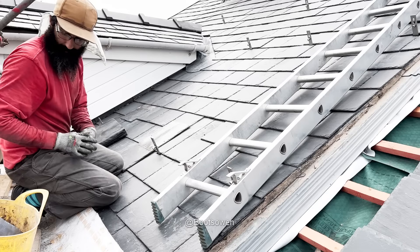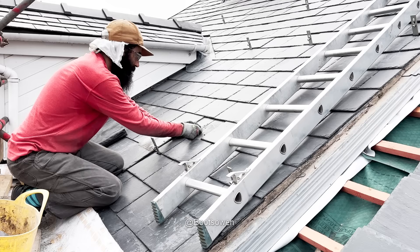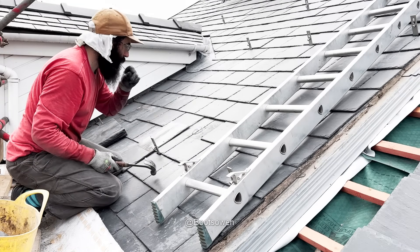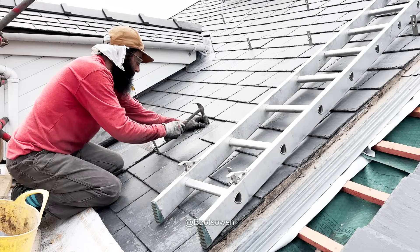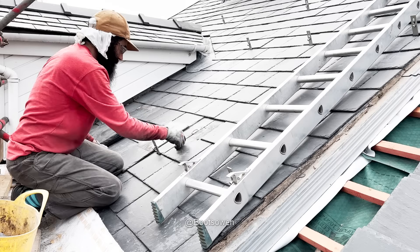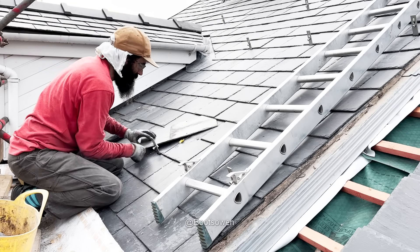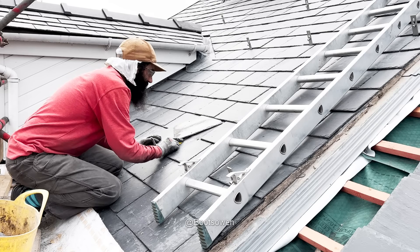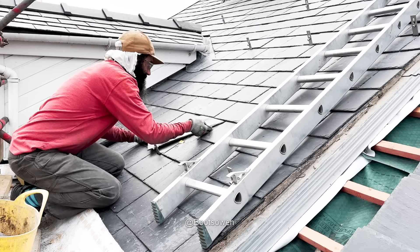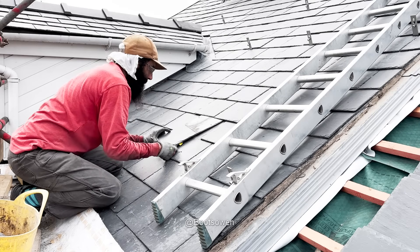Getting this last one in — I had to go off at lunchtime to get these hooks. These are called hall hooks, a proprietary system for putting slates back on that have slipped. You just hammer it in between the two slates above, it pulls down on the batten above, you nail it off, and then you slip the slate in. The other thing you can do is use a copper strip — nail a copper strip in, slide the slate in, and fold the copper up. You could make your own strips out of lead or hammered-flat copper pipe. I chose to spend ten pounds on this pack of ten stainless steel spring-loaded clips, mostly because I think they look better.